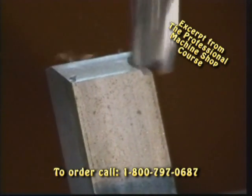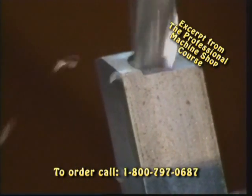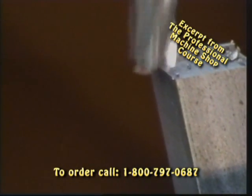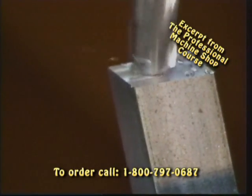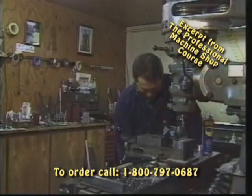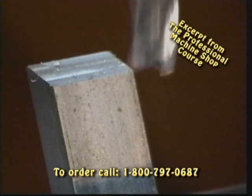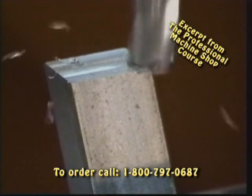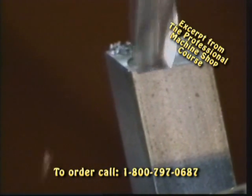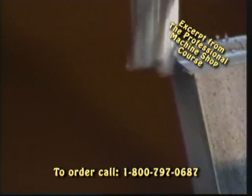Now, remember, this is kind of a climb operation relative to the top edge of the part — we're removing the burr off in this process. Index our cutter over and come across it for the second pass. About another 20 thousandths ought to do it. You can also watch the chip color. You can see the chips are coming off in a nice, shiny color — they're not turning straw or blue color, again indicating too high an RPM or too fast a feed rate.